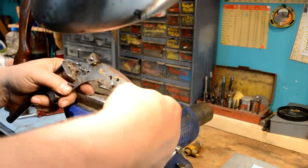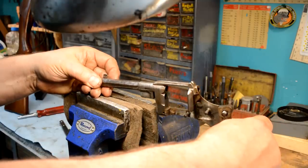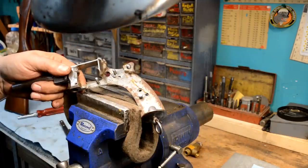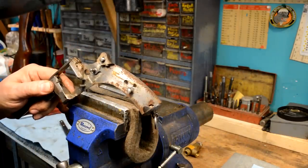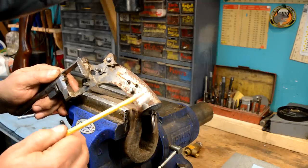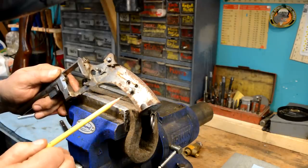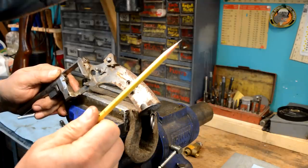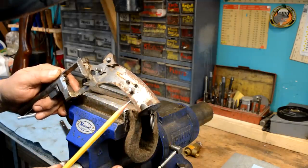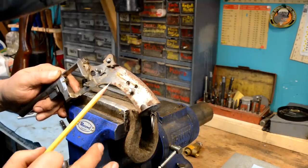While I got this camera jigged, this is active rust on the inside of this gun that I think has not been gone after, because it still has patina. Okay, well, we all know where I come down on the issue of patina. The problem is, all this is a really buffed down version of this. Once rust starts, once you oil it, it doesn't go away. So at the risk of possibly messing up someone's patina, I have to stop all of this, or this gun's gonna die. And there are certain critical things that are tied up now because it rusted. So we're going to go ahead and stop this active rust, brush off the oxide layer, and then leave it where it is. And it will still be wearing anything that it had that was original. I'm not entirely positive that this gun wasn't in the white when it was new. That's also possible because the inside of it is white.